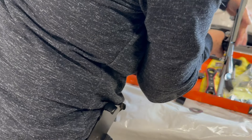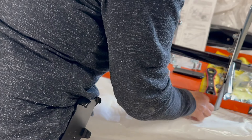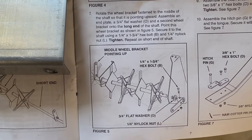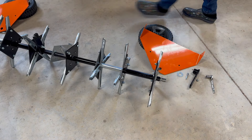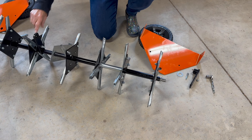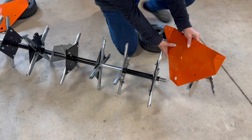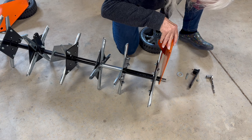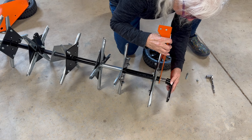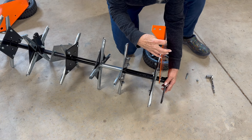Then the 5.29-inch spacer, our last tine unit, the one-inch spacer, and then our last O-ring. The axle is now assembled. Step seven: I've laid these out in the order they're going to be installed — I'm just using the tires to hold it off the ground because I don't like my stuff scratched. This little piece points straight up. We've got our one-inch spacer here and our flat washer — part O — pointed on. Now I'll put a tire under there to hold it, they're in order of how the instructions say. We'll do the long side first; bolt right in there.